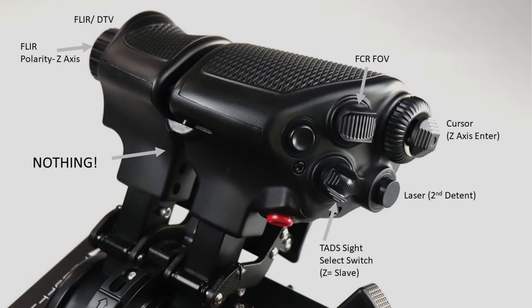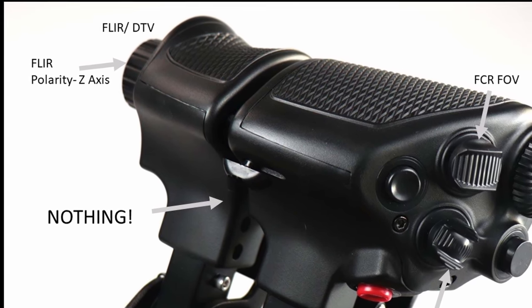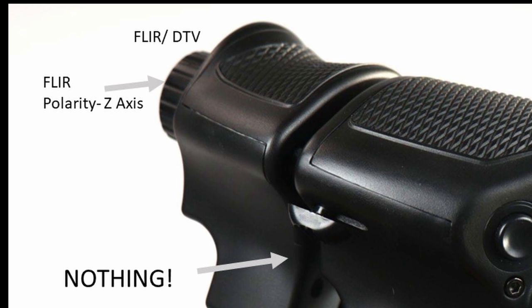We're going to take a look at the side, and going to the far left side there, it's got another pinky switch with a forward and back, and that's right now what I'm using for my FLIR and day TV. I've got my polarity set with that Z-axis push, so I can switch between FLIR and day TV. On the TDAC there's a three-position switch, but one of those really isn't in use — you just have the day TV and FLIR. It's sort of a legacy from the alpha model. So just using that forward and back, and then just change that polarity with the button inside of it.